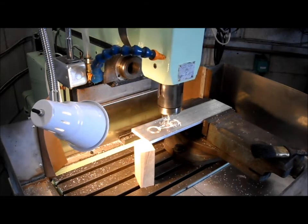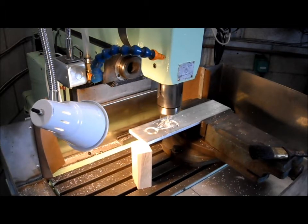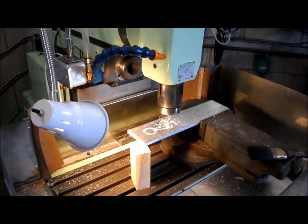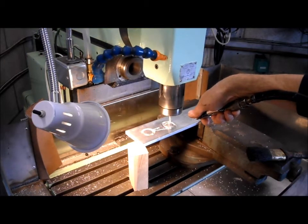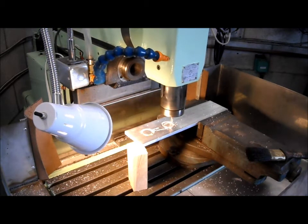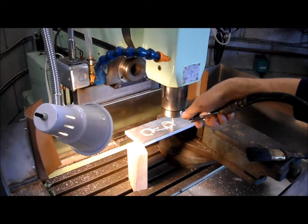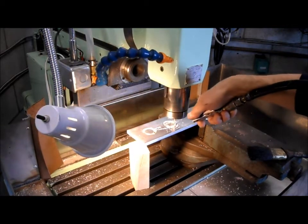Future development is for me to put in the Rogers DRO board, and if I do that, if it sees a lost step, it's going to halt the whole machine and stop this process from happening. So you've got to be really careful with your feed rates, because when you're in the rapids, if it exceeds what the machine can do, then you have an issue with it.